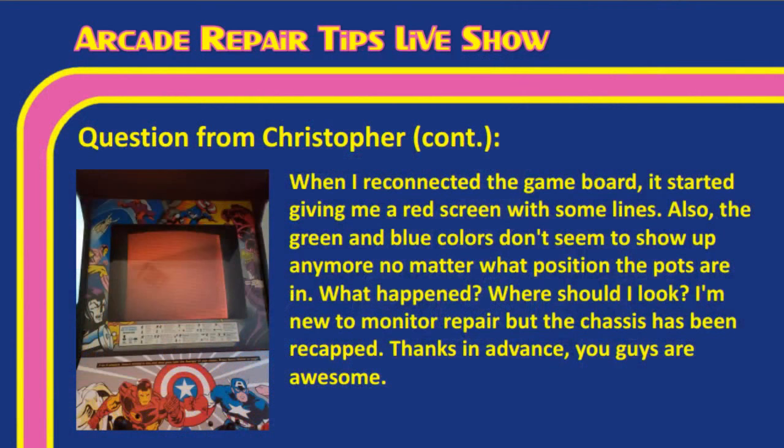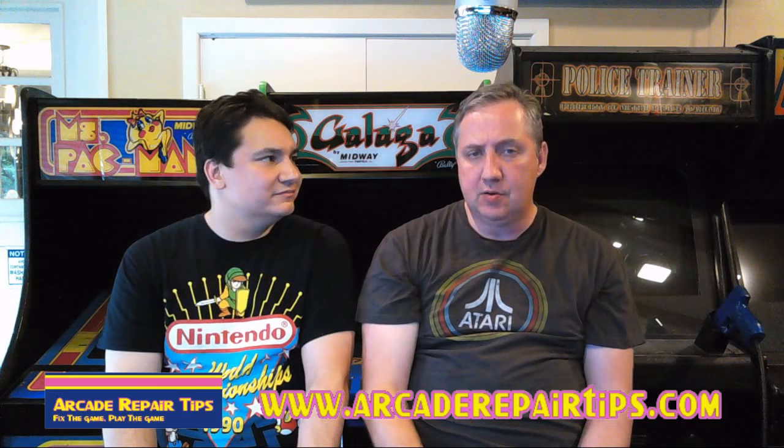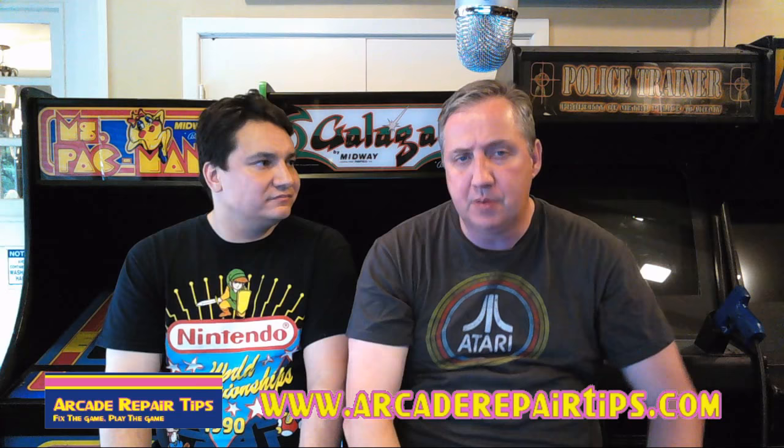Well, if the game is playing, right? It doesn't really say whether he heard the game when this is happening. Remember, not all monitor issues are with the monitor. Sure. Not all picture issues are with the monitor. Right. One thing he could do is unhook his harness and see if his screen goes white. Sure. If it's only red when it's plugged in, right, then he may have a board issue. It sounds like he could have a definite problem with his game board. Right. And the video output of the board is causing the issue.